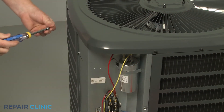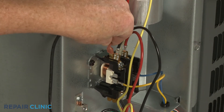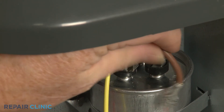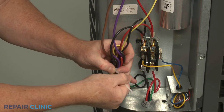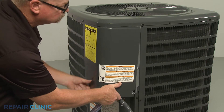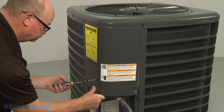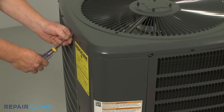Do not fully tighten the two screws above the control box. Attach the black fan motor wire to the contactor terminal. Attach the purple wire to the common terminal, indicated by the letter C on the capacitor, and the brown wire to the fan terminal. Use a new zip tie to bundle the wires together. Reposition the access cover and replace the two lower screws to secure. Now tighten the two upper airgrill cover screws.